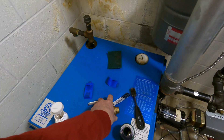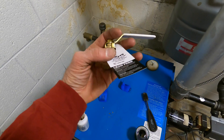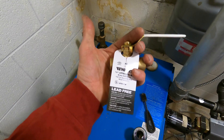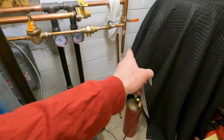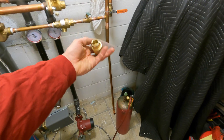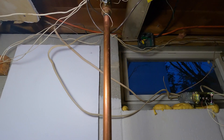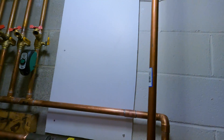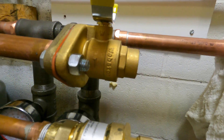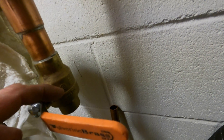Today I'm going to go over how to install a lead-free ball valve. Most valves sold today are either lead free or not. Lead free is for any kind of potable water for the house, and that's what I'm installing this valve for. The indicator on a lot of valves is 'LF' — valves that are not lead free don't have the LF marking. This other valve here is not lead free, but it's just a valve for a boiler, so it doesn't need to be.